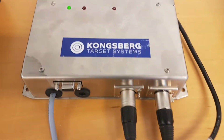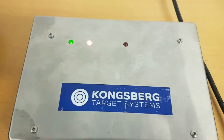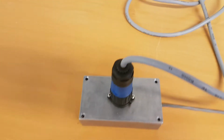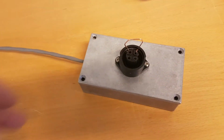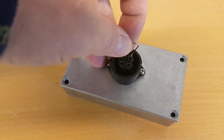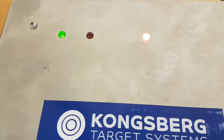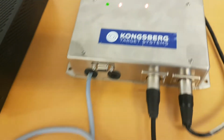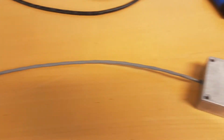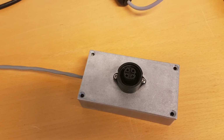And it looks promising because the signal LED is off. But again, the problem might be that we actually have a short circuit somewhere in this cable. So we have to verify by again removing this short circuit and verify that without the short circuit, and with the cable in the system, the signal LED is actually on. So again, good news for us in this respect. We have a system which is so far looking promising.